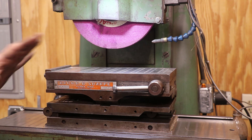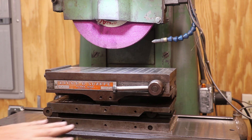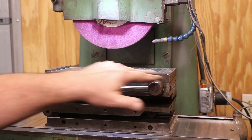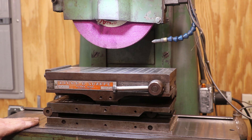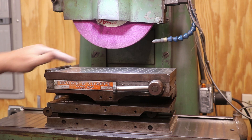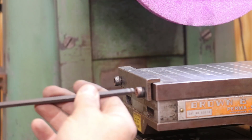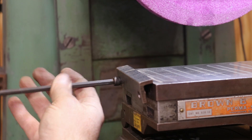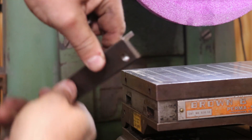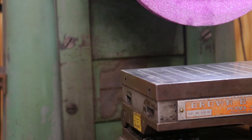We're going to be doing some angle grinding in an upcoming video and I wanted to get this thing all set up and cleaned up. Right now we've got everything set down in the zero position — basically no gauge block stacks in here at all. I want to make sure that this top is nice and flat and parallel to my magnetic chuck below it so we have a nice surface to work off of. I'm going to take this little fence off the end — it's just on here with a couple of cap head screws. This fence is just for you to have something to put a part up against for reference, but for what we want to do we want to get the whole table ground out to the very end.